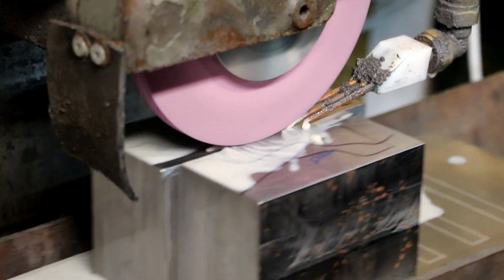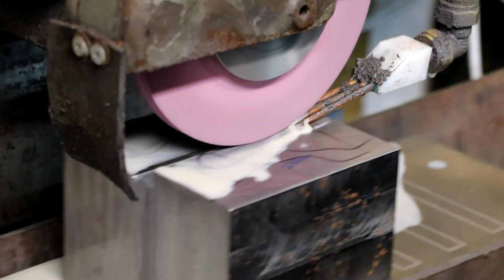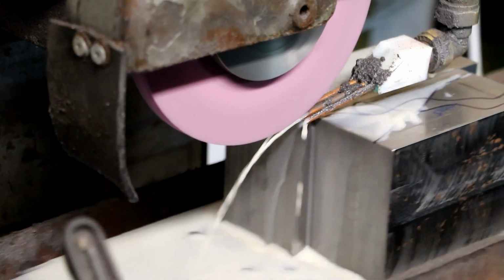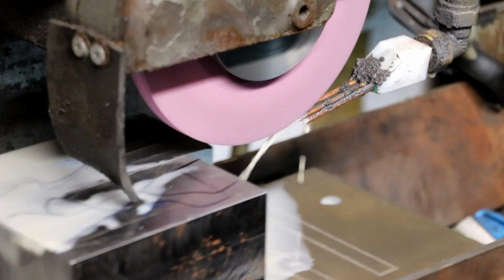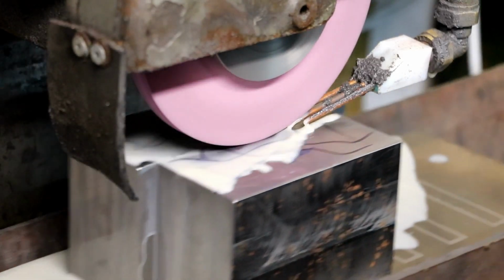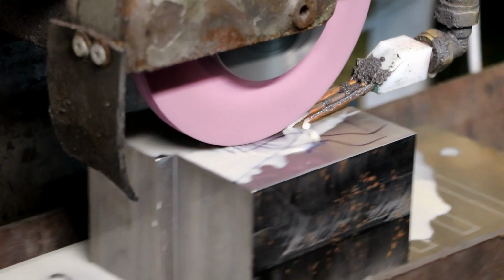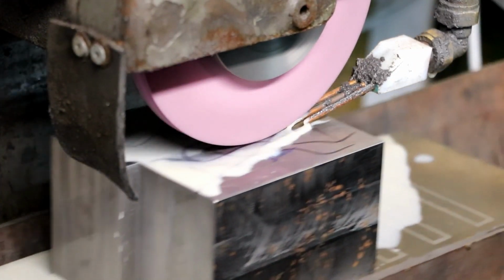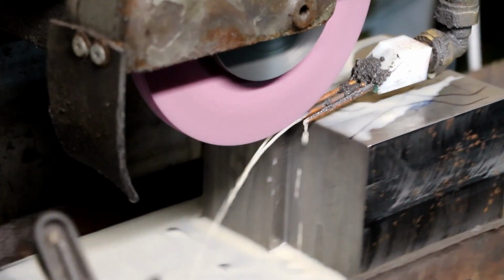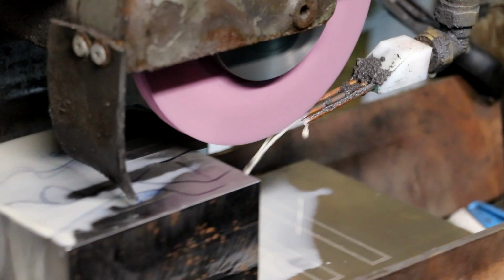Be interested to see now if it touches this other block, won't it? So yeah, going back to what I was saying, to get them roughed in, then drill all the holes. Not that I think that the blocks are going to move when I drill the holes, but you just never know, do you? And then once I'm happy with all that, we'll get them back on the grinder and we'll do one final grind to try to get them as good as we can.